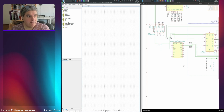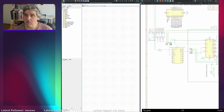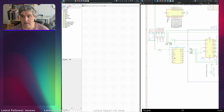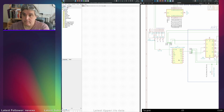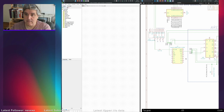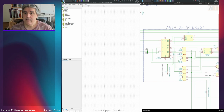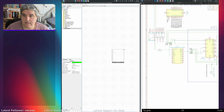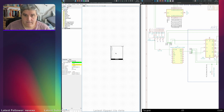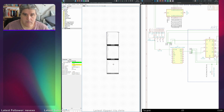And this part of it here has just been done as a shorthand. We've got 4 RAS pins, 4 CAS pins, so there's going to be 4 banks of chips and 8 in a bank. 9 if there's parity, actually. There might be parity, I can't remember. But you've only got 1 shown in this schematic. One, two, three, 4 for those.